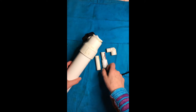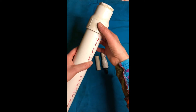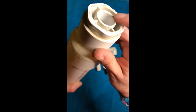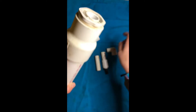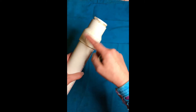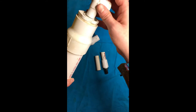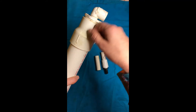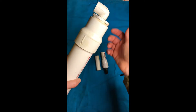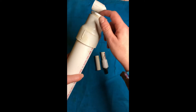Now I'll assemble the gas line. This is two-inch PVC schedule 40, with a two-inch to one-and-a-half-inch adapter, and on top is a one-and-a-half-inch to half-inch bushing. You don't have to use this exact setup, as long as you get down from two inches to half inch. This is half-inch slip and it goes right in here. I usually don't glue this until I've placed the biodigester, because I want the gas line to swivel until I've made the final decision about placement — then I'll glue it.